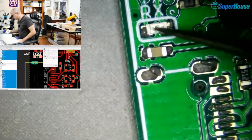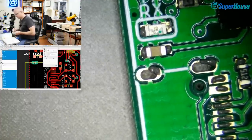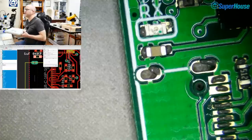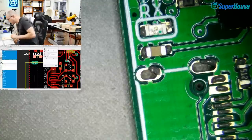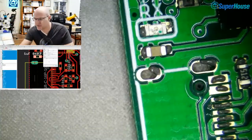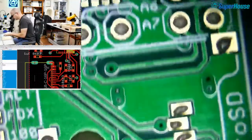Oh, look, you can see I've got just a dab of solder paste. There must have been some solder paste on the nozzle, which can happen after something goes wrong, like you get a mispick and then it tries to place it because it hasn't detected the part isn't there. And you can end up shoving the nozzle of the pick and place machine into the solder paste, which is never good. You end up with solder paste stuck on the nozzle and then it attaches to whatever part you pick up next. And sometimes it can do things like make it difficult to put the part down. And that's one of the reasons that I set up positive pressure on my machine. So I've got a little aquarium pump.